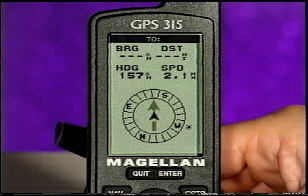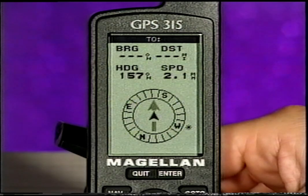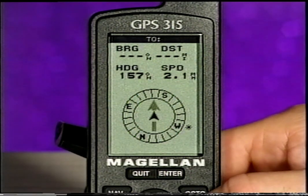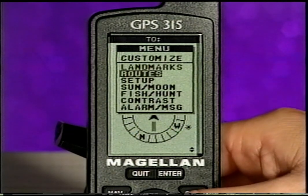Your Magellan GPS is designed to provide a wide variety of navigation information that will help you get around the great outdoors in many applications. You may find that only a few of the 9 navigation screens are useful in your application. In addition to providing user-selectable data fields on most navigation screens, you can also turn individual navigation screens on or off. To select which navigation pages appear, highlight the Nav Screens option and press Enter.